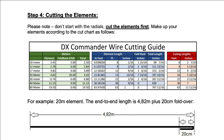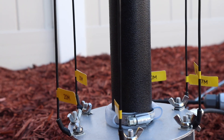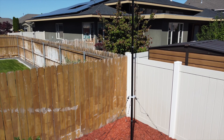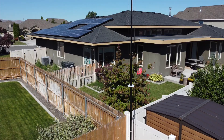I tried to outsmart the directions a bit when it came time to cutting the wire. Since I'm predominantly a CW and digital operator, I figured I would cut them a bit longer so my SWR dip would be a bit lower in the 40, 20, and 10 meter bands. Turns out you're much better off to just go with the measurements that Callum provides. Now you may have noticed that I tagged each element — I highly recommend marking your elements somehow. You'll thank me when it comes time to making adjustments. It's much easier to find which one is which, rather than having to trace from the plate up to the top of each element.